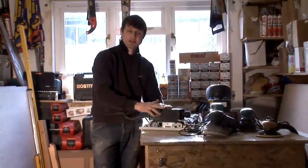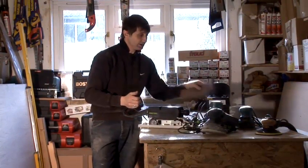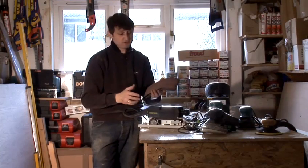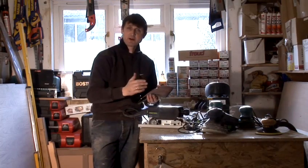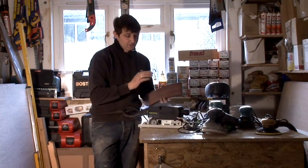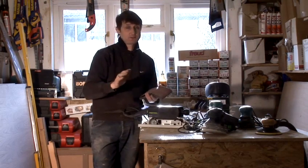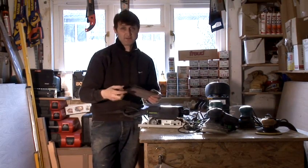This will arrange and take out a large amount of stock. I can put different abrasive belts in it, anything from a 500 grit right down to an 80. The lower the number, the higher the grit, so an 80 grit is quite abrasive and will take out a lot of timber. The thing to remember with this machine is don't go across the grain because you'll end up with a number of scratches that you can't remove, particularly in fine carpentry.